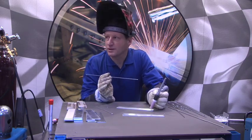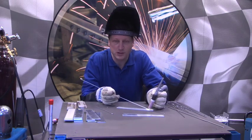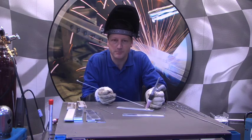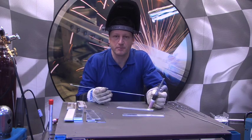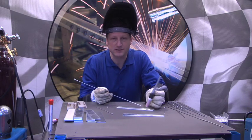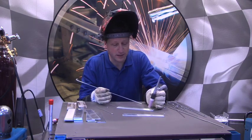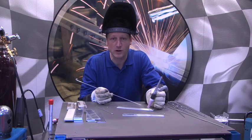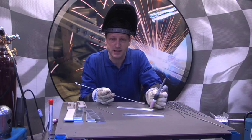We try to tell people to start introducing the filler metal with a dab and move motion — dab it, move the torch — and just pick up that rhythm. There's no need for excessive torch movements. It's not like oxy-fuel welding where you're constantly moving the torch in the heat zone. This area here maintains a steady motion.